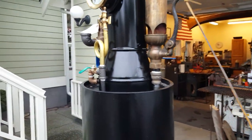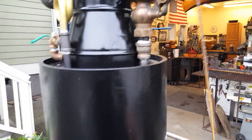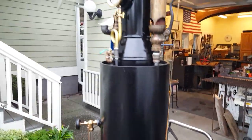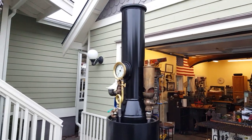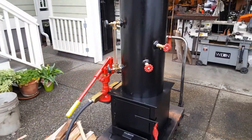The whistle — you just pull the handle when you've got steam pressure up. You need about 50 pounds of steam pressure to make the whistle sound correct. You could do it for less, but it doesn't sound as nice.